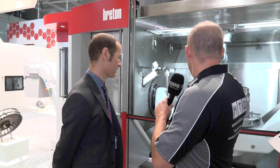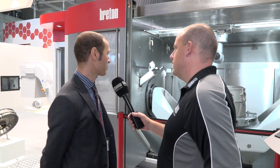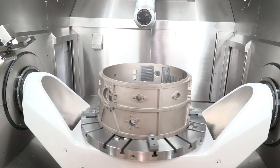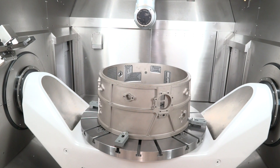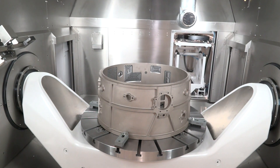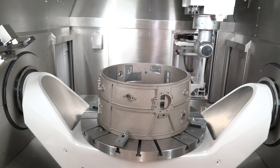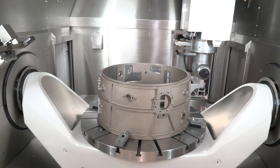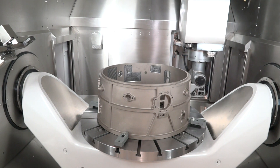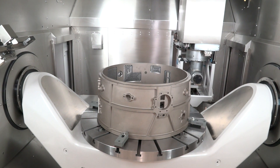You've got the rotary axis here, the table here, and the head here. One of the special designs of this machine is that you can have an angular head or other special accessories stored in the back of the machine. There's a two-position changer and the machine can automatically collect this because there is a hydraulic clamping system. We can call it an angular head, or just a 90-degree reversal of the full power of the machine.